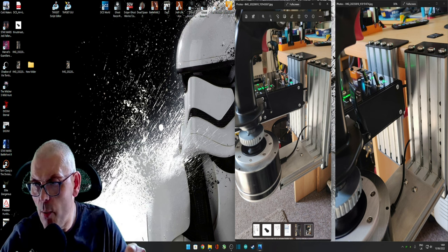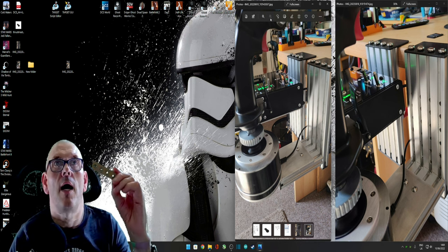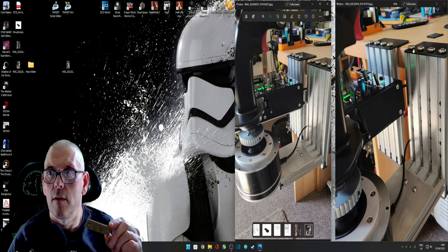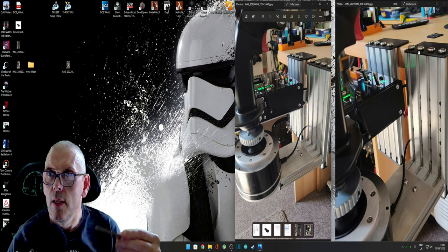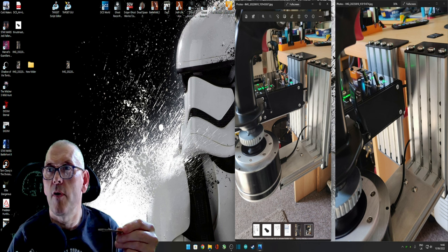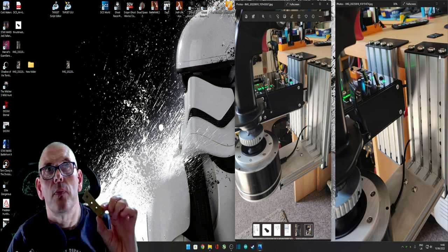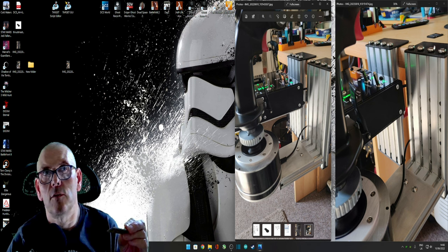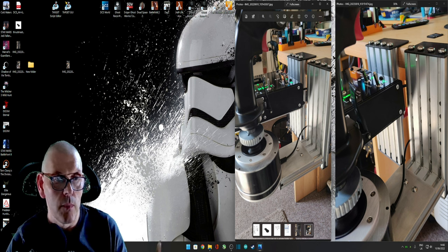How I got some of them to work out is I got some cardboard, and this is for this top bit. You can see I've cut this to the right size, 20mm by 80mm, lid up the top. I just got something pointy, and found the holes, punched them through, transferred it to that, and then I marked that onto the steel to cut the steel so I could pop a punch mark into the metal and then drill it out. So that's how I've done that.